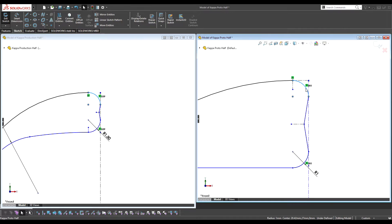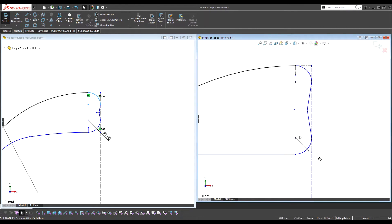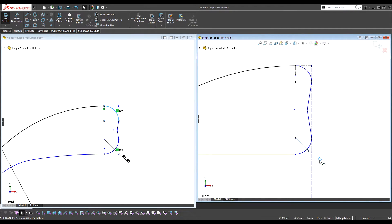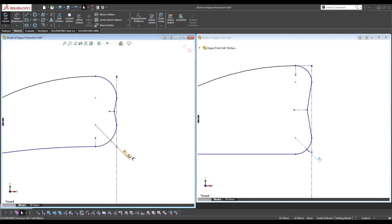Looking at the prototype sketch, the rims are just boring old fillets — nothing remarkable. A fillet is just a way to round out a corner or transition between lines. But these arcs are not created equally. The prototype has a fillet with a radius of 1 millimeter, and on the production it is a radius of 1.5 millimeters — one and a half. So that's a bigger, rounder arc. There's more surface area when the yo-yo touches your hand when you catch it or bonk yourself, so that force is spread out more and it feels better. And it was just a tweak of half a millimeter in radius, but the change in comfort really can't be overstated — it was quite dramatic.